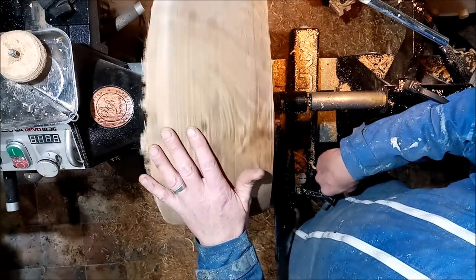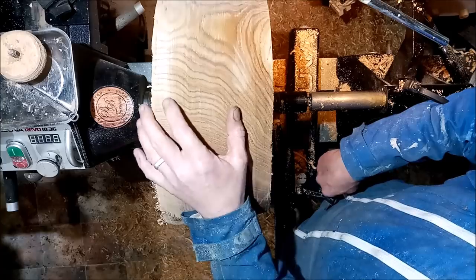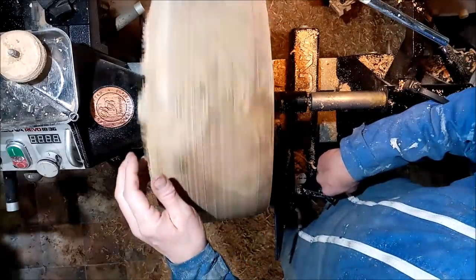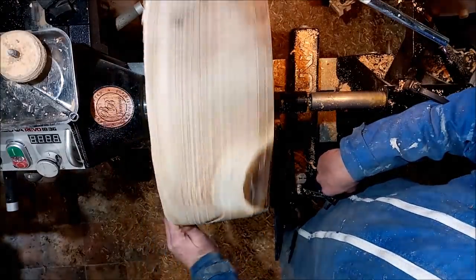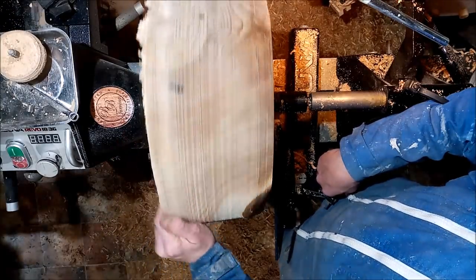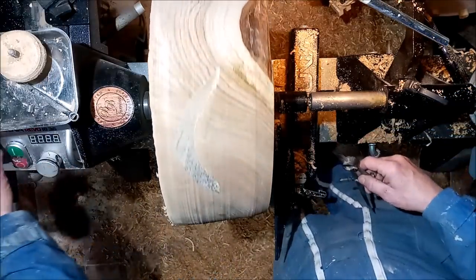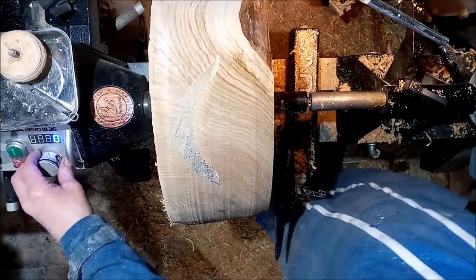I would never use a mortise on an end grain bowl. You're forcing the fibers apart at their weakest point. That way, what you need to do is crush on that. But on wet bowls, I always use tenons, because, as I said, they're just easier to reshape than mortises. I'll go further into that in a different video.